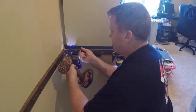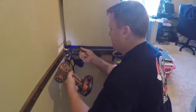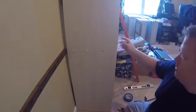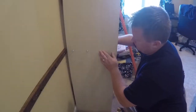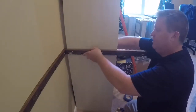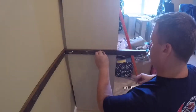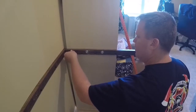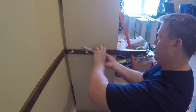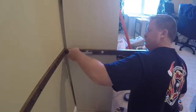After we drilled all three holes, we remove the board, remove the tape, and hook it back up with our carriage bolts. I pre-painted the ends of our carriage bolts to match our shelving unit, so we just pass them through the holes from the inside. Once all three are through, we take the ledger board, put it into place, and secure it with our washers and nuts. Hand-tighten them all with a ratchet — do not over-tighten or you will pull the carriage bolt through the wood of the shelf.